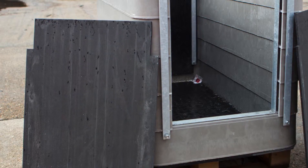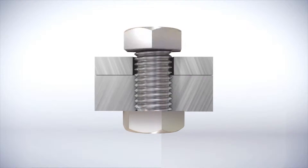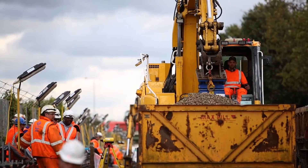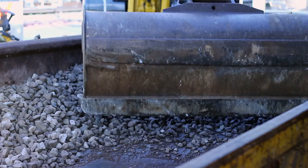If they're not, the ballast boards allow for 80mm of adjustment. Once the inverts are correct, simply tighten the securing bolts and repeat the process for the outlet pipe. Once accurate, backfill with P gravel to above the ducts and then continue up to the surface with ballast.